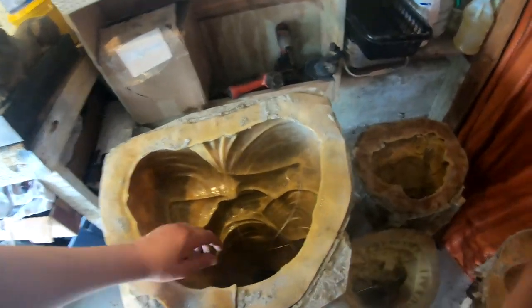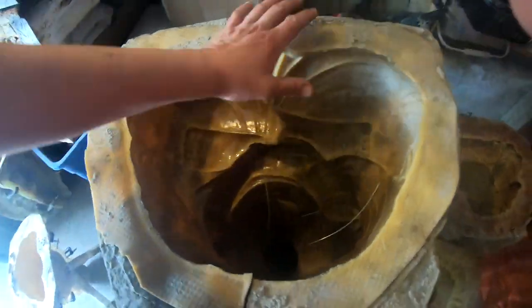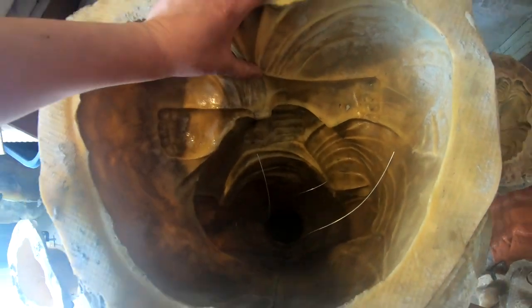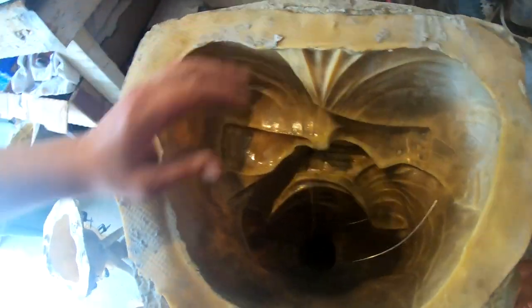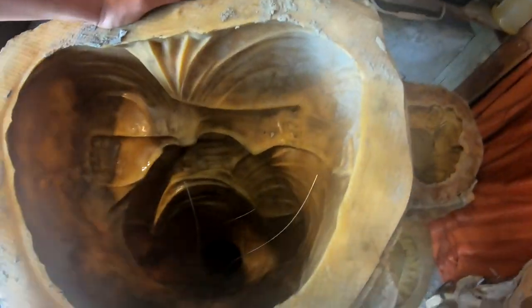The other thing we have to do is for some of our taller pieces, we're going to stick some wires into the neck area because we don't want the head to snap off, especially when the concrete is fresh. That's also going to help us pull the statues a little bit quicker. For instance this really big guy — he's about three bags — I can pour him and I'll probably let him sit a little bit longer. The little guys you can pull in about two hours, but the bigger guy I'm probably going to let sit for about five hours.